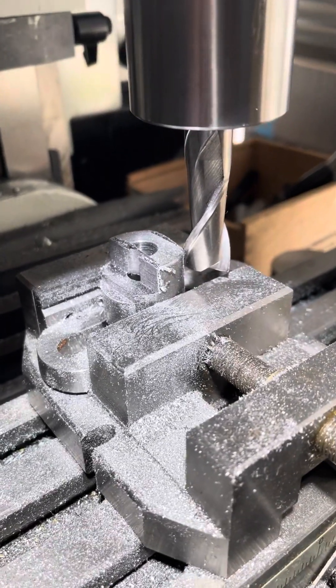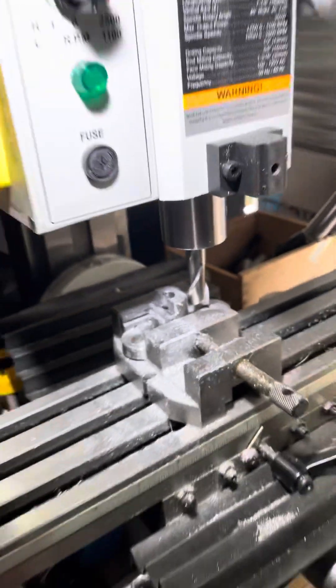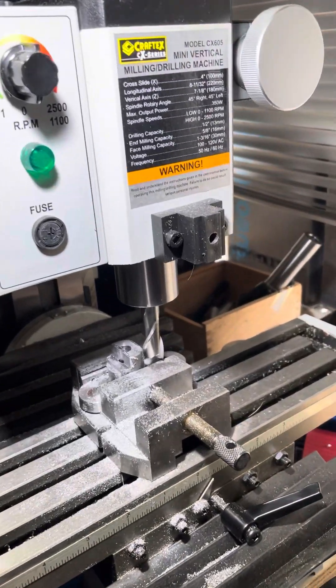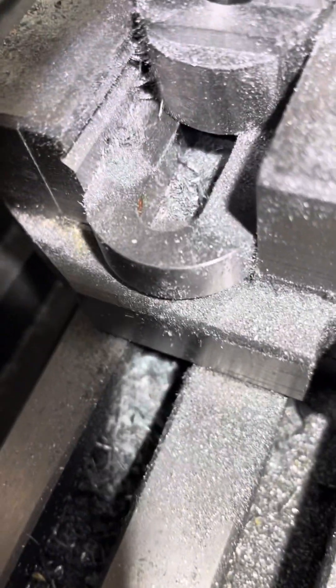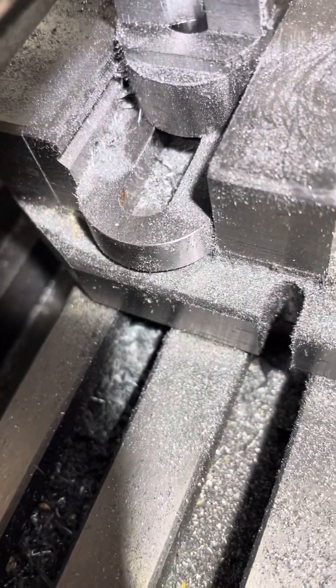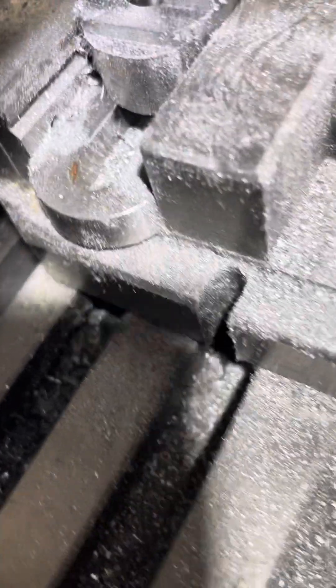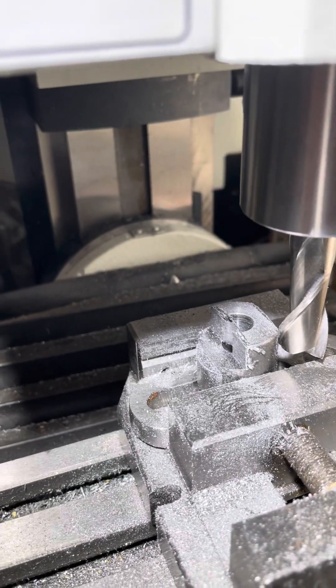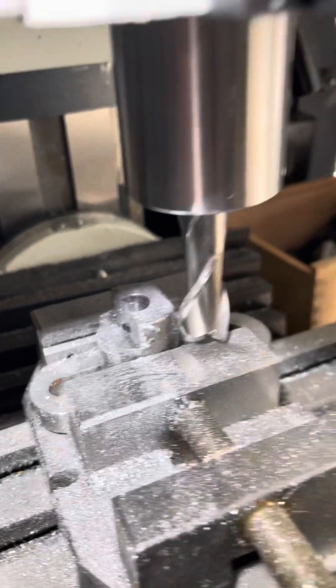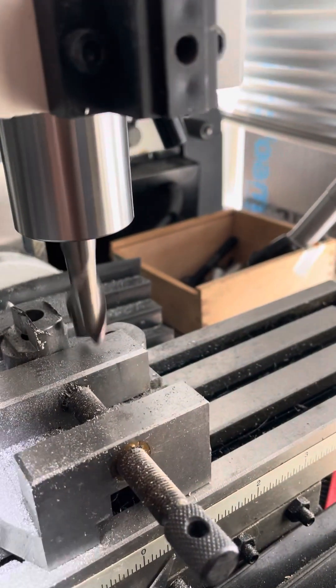For those who've never seen a milling machine in action, this is the little Izzy B mini-mill. I'm just machining both sides of a boss. I'll eventually flip it — it'll fit in this slot in this round piece underneath here that I'm just using as a parallel to keep things level. So I'm taking 10 thou at a clip off here and running at a fairly high speed.